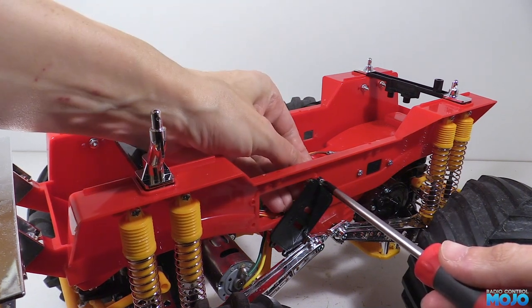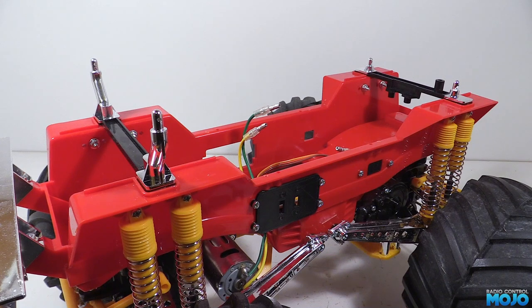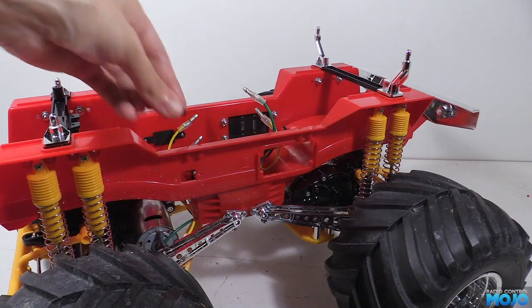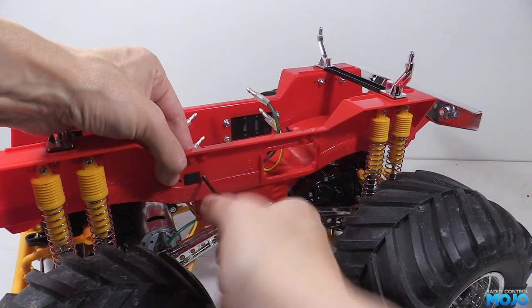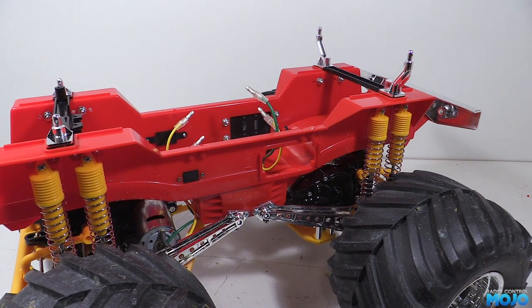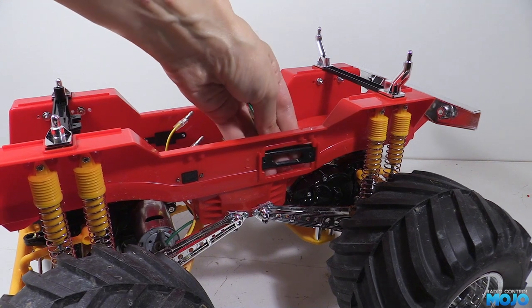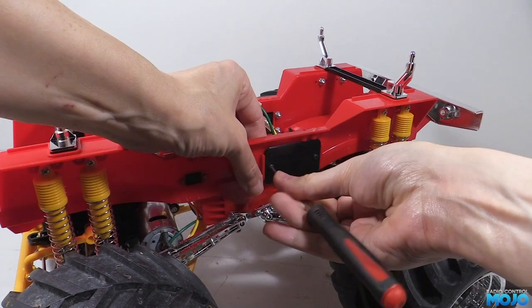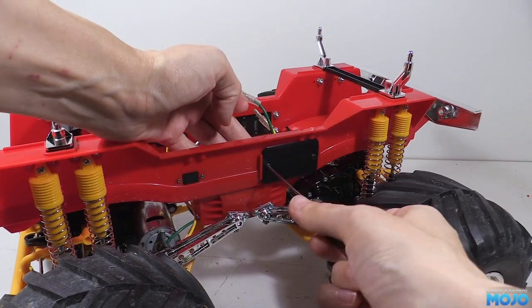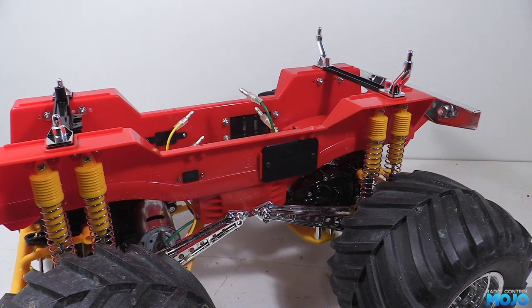It all depends if I have time before the video goes live. The blank fits in with the stock screws and nuts from the outside. On the other side of the chassis we have the smaller switch blank for the power switch hole — this one uses a pair of M2 screws; the ones that come with the kit work just fine. For the last blank we have the removable end cap. This one doesn't have any convenient screw holes so it comes in two parts: one bit sits inside the chassis and fits snugly across the hole, then the plate goes on the outside and uses two M3 x 8s to clamp the two parts together. You could print them in red if you really wanted to hide them, but I quite like them in black.